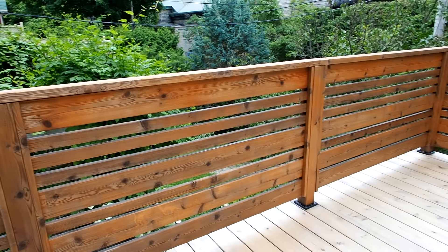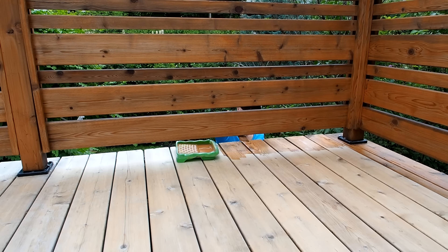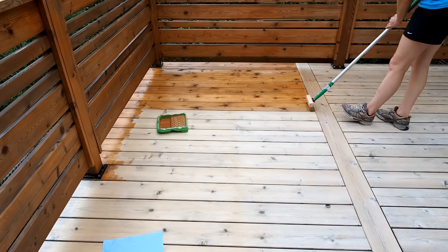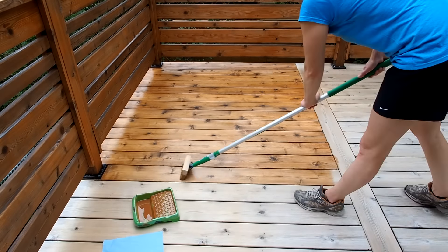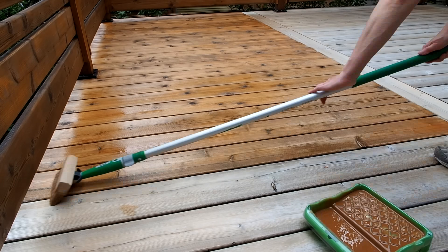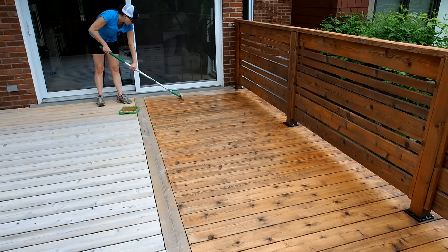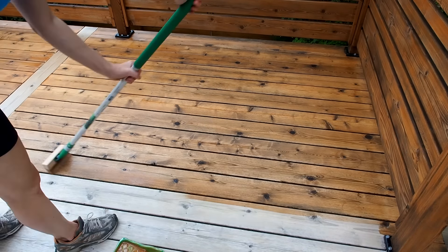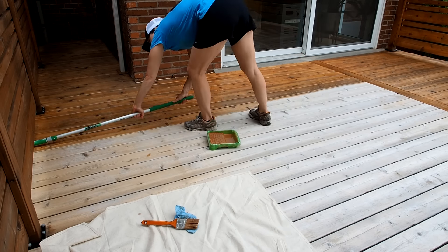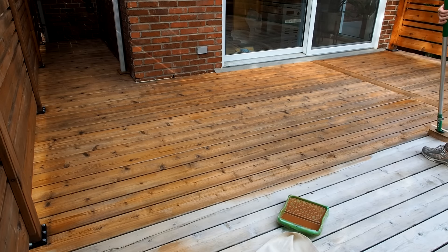Once all the railings were done, I started on the deck itself. I would first go up the ladder to get the exterior edges, working one small section at a time so the stain doesn't have time to dry out, and then use the detail brush to go around any obstacles like post anchors. I could then grab the floor brush and apply oil to the floor boards, being very systematic and going with the grain one board at a time. I actually realized that the floor brush fits under the railings, so no need to run up and down the ladder. The railings are the most tedious part, but if you only have the deck to refinish, it's actually kind of fun. I did spend a full 12 hours applying the first coat, but the floor itself only took a couple of hours and that's the most satisfying part.